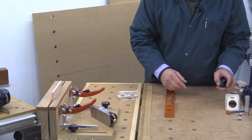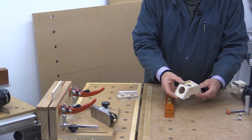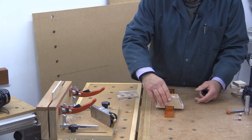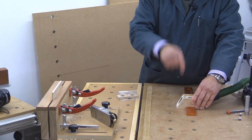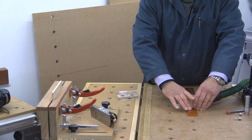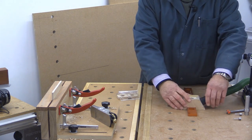Now, what I'm going to show you today is a very, very simple gadget. And you can make this yourself. This is a simple little accessory which fits over here like that. You attach your hose like so, and then you would start drilling. And as you push down on this, it's helping to keep the 20mm guide block in place and you're doing the extraction.